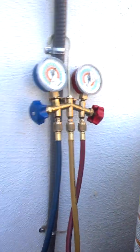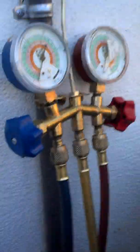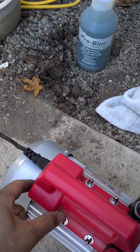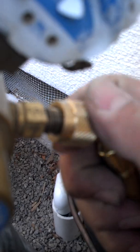What I got is a vacuum pump hooked up to my gauges. I'm gonna reach over and close them off, then reach over and turn this puppy off. Undo my hose here and stick it on my nitrogen, nice and tight.